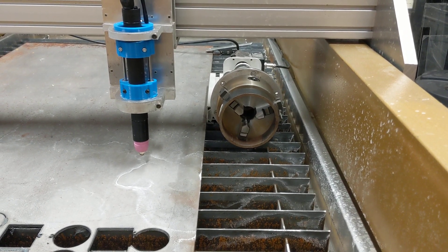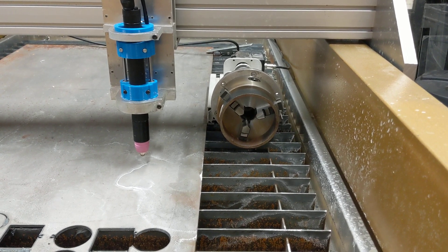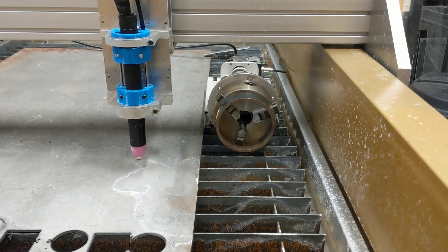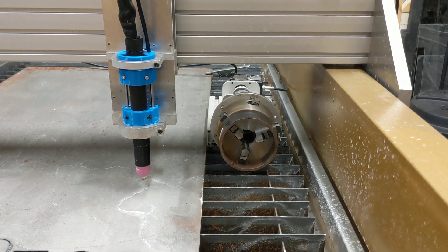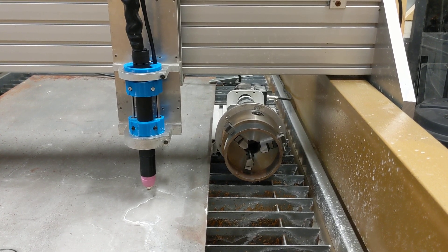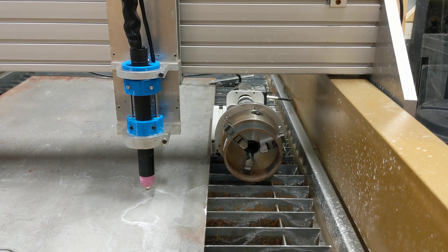So I've gone a different route. I've decided to essentially unroll the pipe — cutting to a flat surface — and create g-code just in the X and Y plane. I've swapped the A axis and the X axis over inside Mach3, and I've created a new profile for a 114.3mm diameter pipe, which is what's currently on the machine.